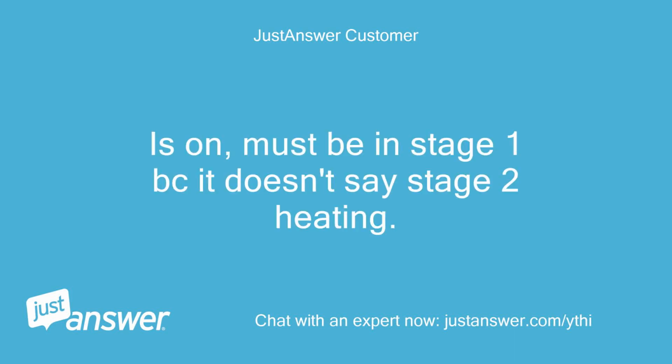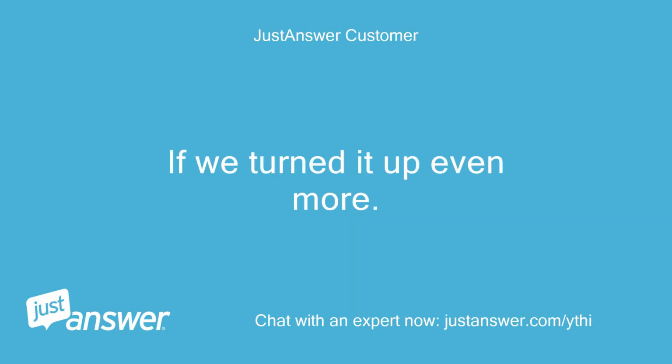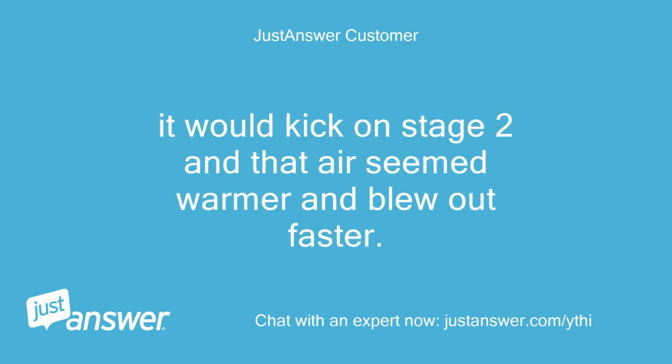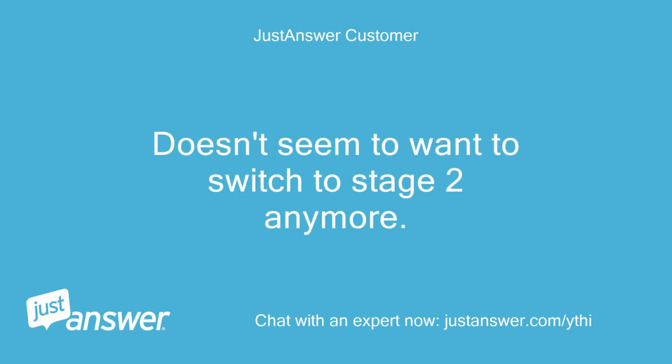Is on, must be in stage 1 heat. It doesn't say stage 2 heating. Before it would cut on stage 1 and that air didn't seem very warm. If we turned it up even more, it would kick on stage 2 and that air seemed warmer and blew out faster. Right now the air coming out doesn't seem warm. Doesn't seem to want to switch to stage 2 anymore.